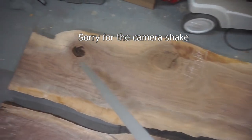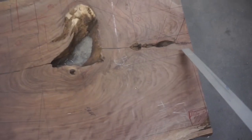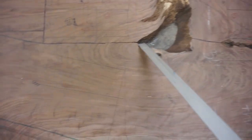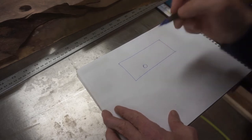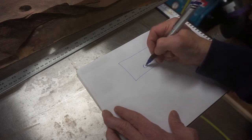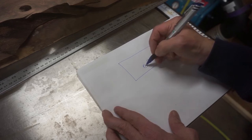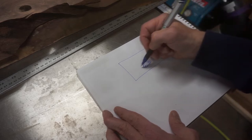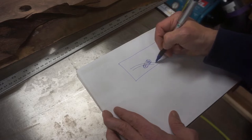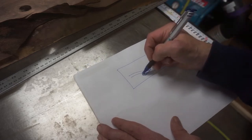The next step is to take my jigsaw and cut along these dark lines to break this big slab into smaller, more workable pieces. If I have a board where on one side I have a knot that doesn't seem to be in the same position on the other side, what I'll do is drill a hole through the knot, then flip it over and drill a hole through the other knot. If the drill holes are way off, I know there's an oval-shaped area I should not be using, because the knot may have occurred at an angle and could touch my piece.